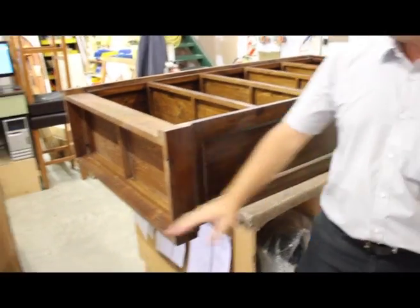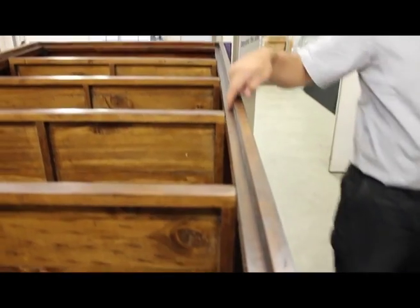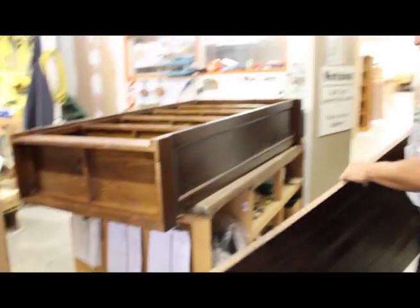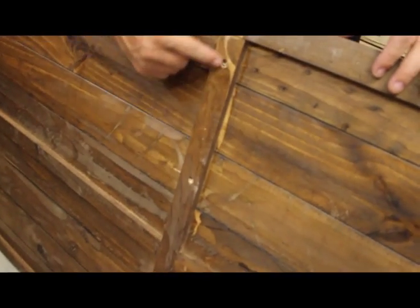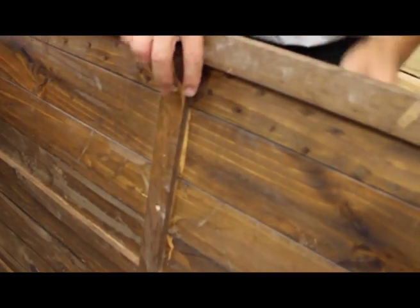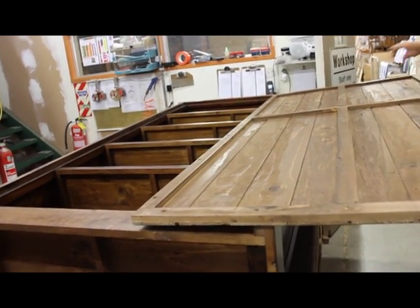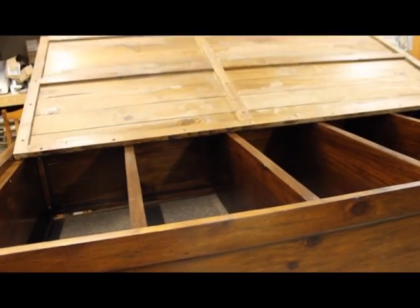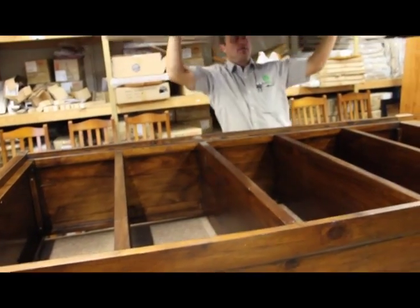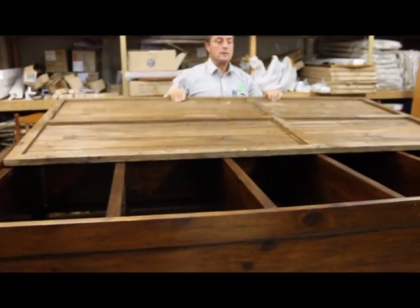We now go to the stage of putting the back on. Just slide the bookcase on its face edge, the back facing upwards. Notice the cross rail, that should line up with one of the shelves. Just place that on the top. The center rail is off the shelf, so that's the wrong way. Spin it round and that should all line up.